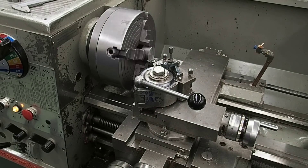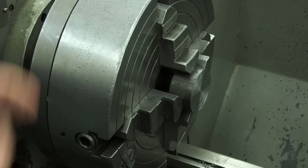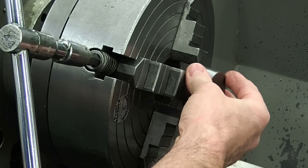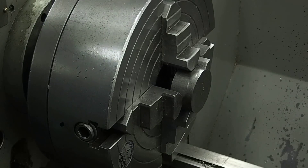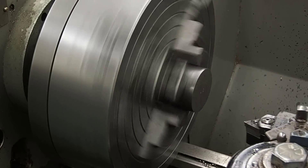I'm going to move the carriage away so we can get at the work. Running true is not critical because we're not turning the outside diameter - what we're doing is a facing cut. Because the part is round, each jaw should be in the same distance. I'm going to put a magic marker mark on two of the jaws, loosen those two, grab the work and flip it 180 degrees to face the other side, then tighten the two marked jaws. This piece should be very close to the same position - and it's not turning too bad.